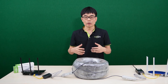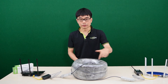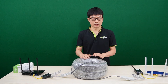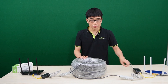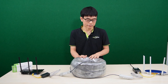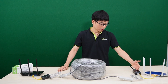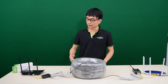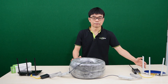In the standard PoE solution, there is always a power handshaking process. Before the PoE injector or PoE switch sends power through the Cat5 or Cat6 Ethernet cable, it needs to make sure the edge device is a PoE-compatible product. If your edge device — like this router — is non-PoE equipment, the PoE injector will not send power. This is the basic protocol from PoE. So by placing the PoE splitter at the end of the cable, the injector will send power, both PoE extenders will get power, the whole system will be up, and you'll get data on the second router — about 1,000 feet from the first router.